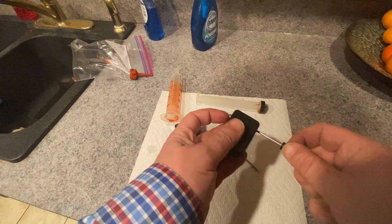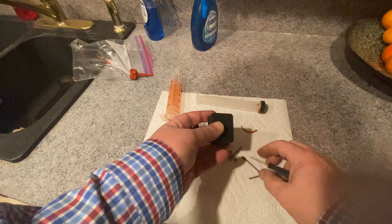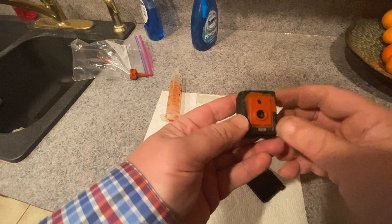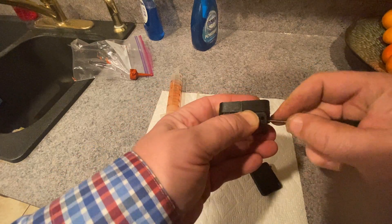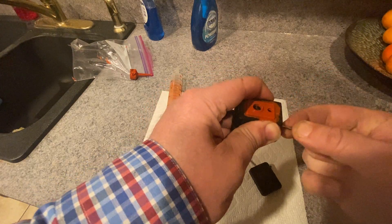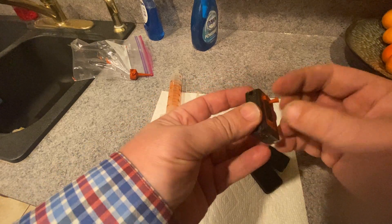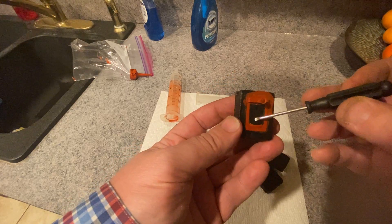Take that apart, take this apart. The key when you take these apart is to go slow, because if you rip it you tend to tear the material. Now we're going to carefully unmold this — that's the bottom face — and that doesn't look bad. I'm going to try to pry the other side off. Sometimes it binds a little bit. There you go, coming nice and clear. You don't want to rush — here's the part where we injected the silicone, and remember I said you had to inject in the hole that's far away from the screw hole.